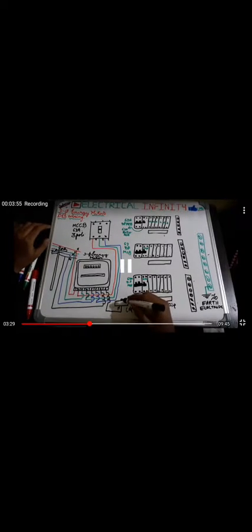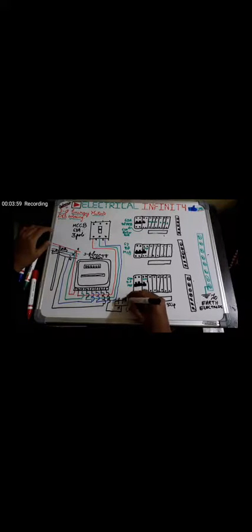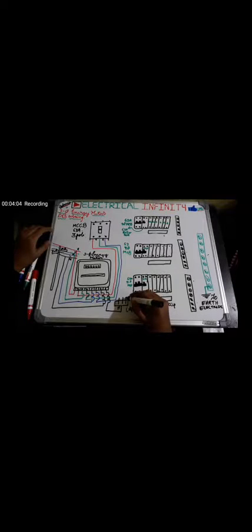After that it's time for the neutral connection. A neutral wire from the utility pole is connected to the 7th terminal of the energy meter, and from the 8th terminal the neutral is taken out and given to a copper bus strip. From here we are taking 3 neutrals out, 1, 2 and 3, and these 3 neutrals are given to the 3 blocks of each phase.